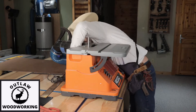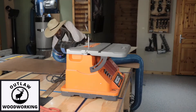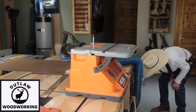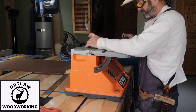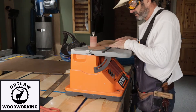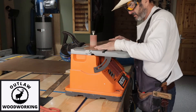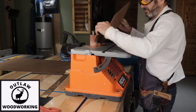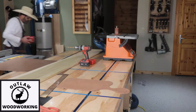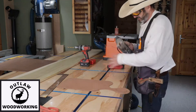After I get it shaped, I'll transfer it over to the piece of poplar. The Ridgid sander is really working out nice. I jigsaw out the little hole and make a little template. I'm using the half-inch sander to go inside that small area of the inside of the handle.